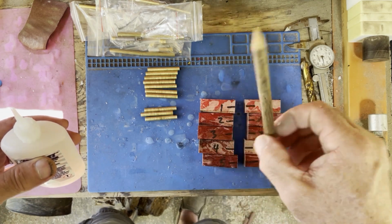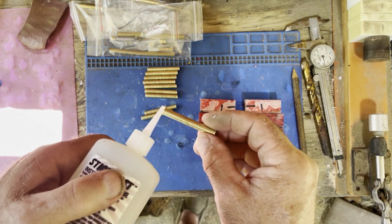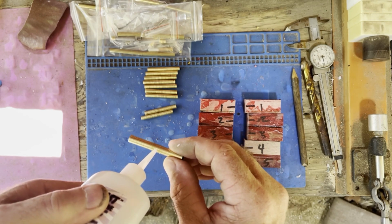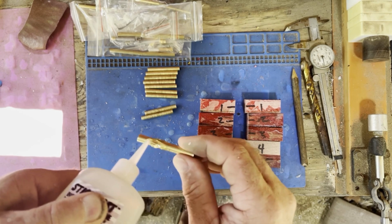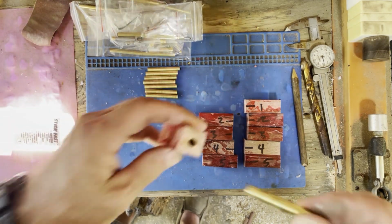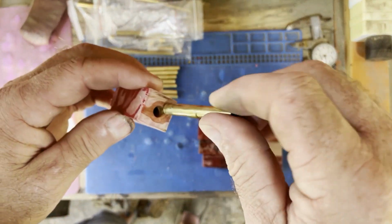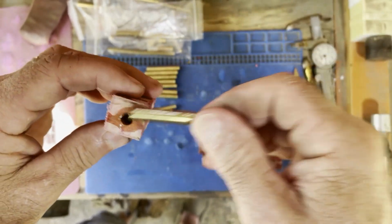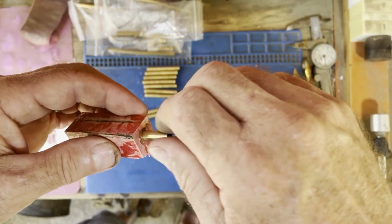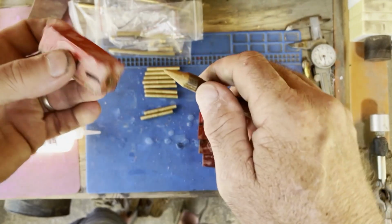And get you a little wooden dowel rod. You can buy the special insert tool they use, or you can just make your own tool. One thing about that dowel rod, whenever it gets coated up with CA glue, all you gotta do is take it to the sander and sand it down. But you just work both sides here. Make sure you got it in a hole, countersunk.